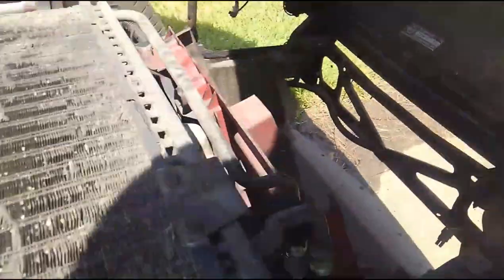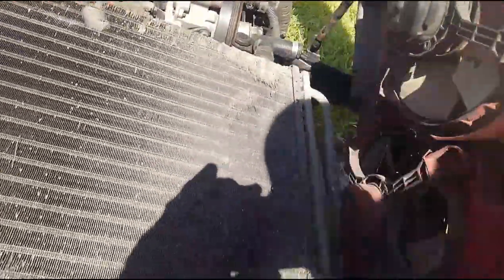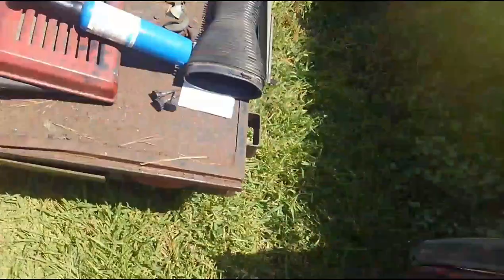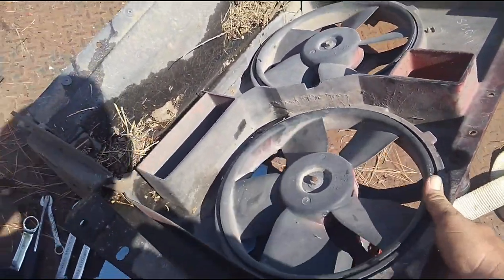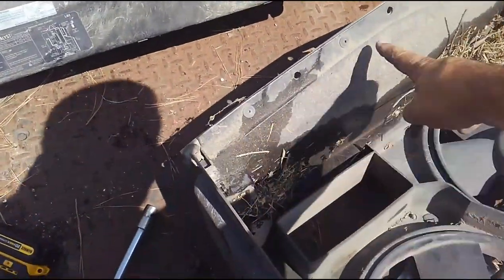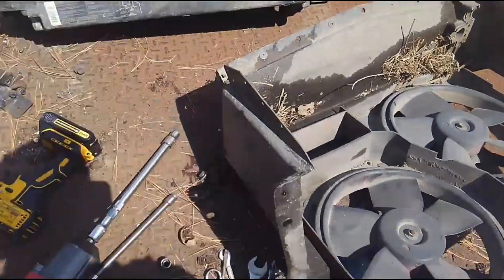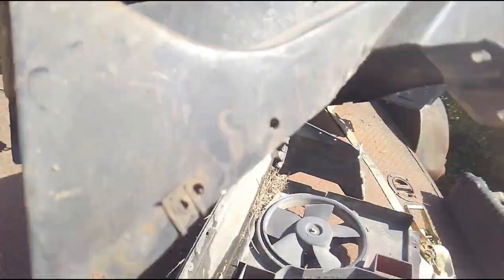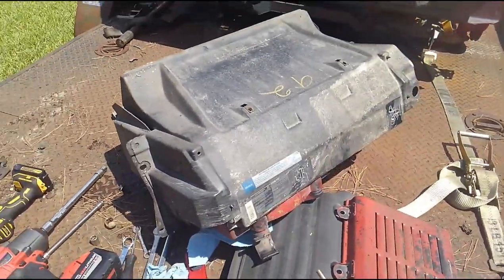Alright, I'm back here with the final pieces out of the way. One thing you'll want to do is go ahead and remove that connector from your fan motors, and then I'm just going to pull straight up and out. And there you go — that is the cooling pod removed from the Corvette. You can see from the backside how those fans are installed. That's where your lower air dam attaches, directing air up into the radiator through this funnel-shaped section, and there's your upper assembly on top. The whole cooling pod assembly in one big piece.